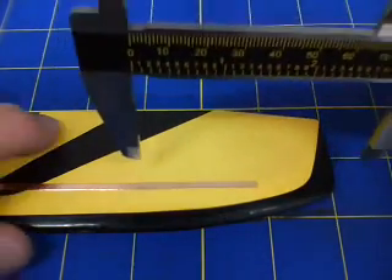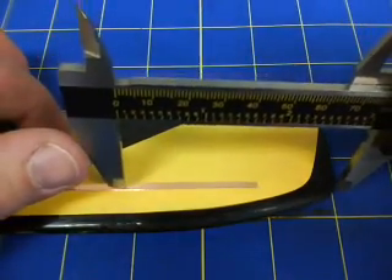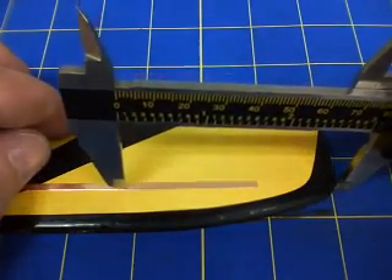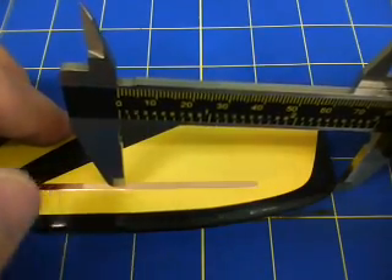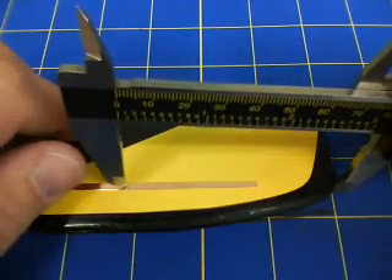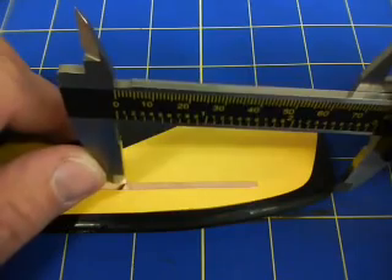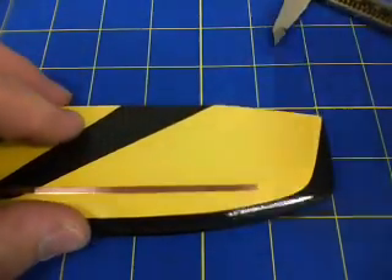What I'm going to do is put the calipers in line with the tape. I'll put one tip on the line. So what you see on the far right where my thumb is motioning towards is on the yellow line. I'm going to take this tip of the calipers and scribe a mark in the copper — that's where the first LED is going to go.